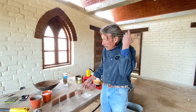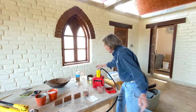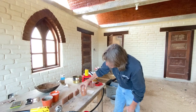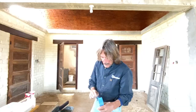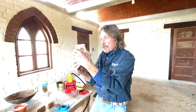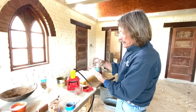The first test we're going to do is called the jar test. You fill a jar to about a third full of soil - not an exact percentage. This is the clay soil. We'll fill another one with the sandy soil, about the same. When we have the dry soil in it, we're going to put a piece of tape right here. It will demonstrate that if either of these soils are highly expansive, the finished product will have raised pretty far above the tape - then we know it's highly expansive soil.